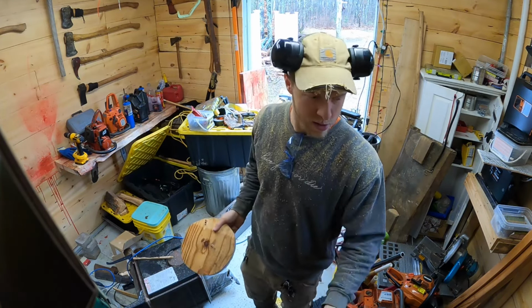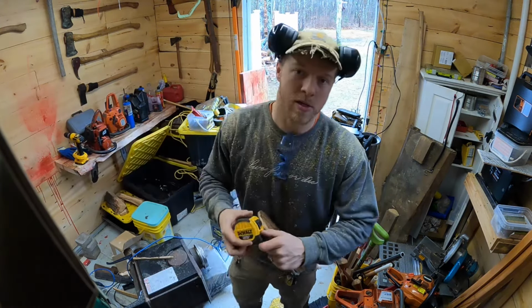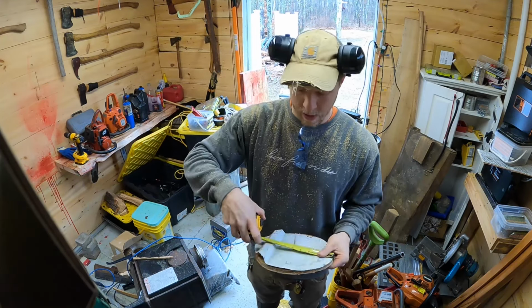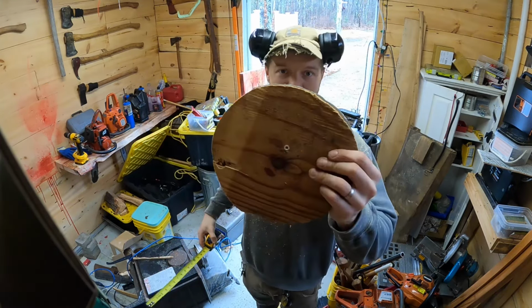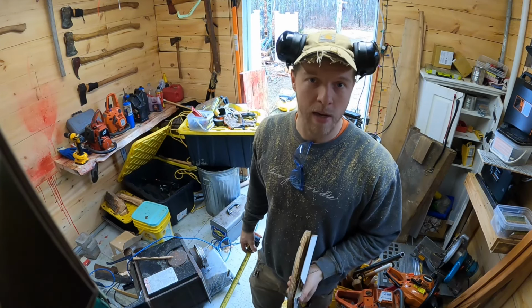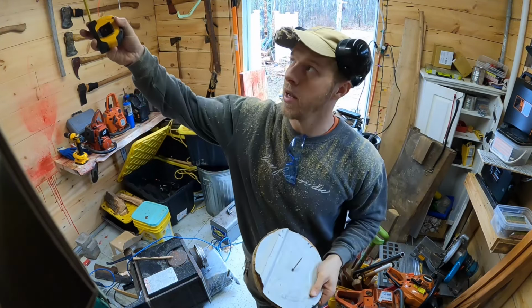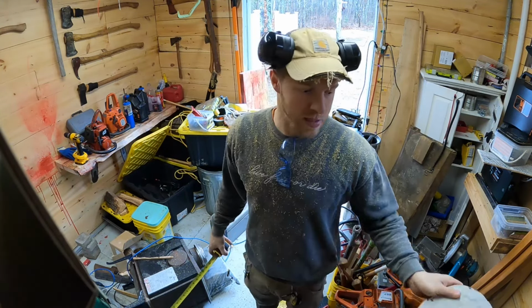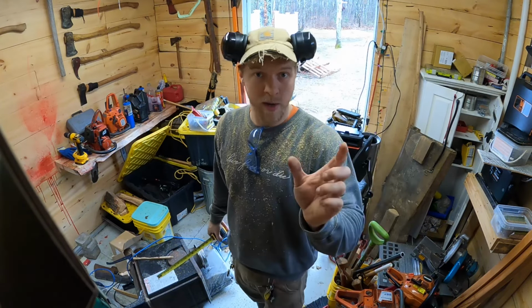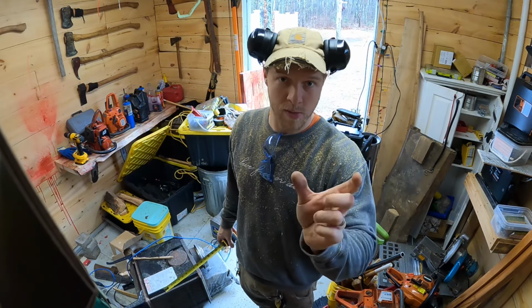The issue we ran into, and this is a wood stove installation mistake, is with your double wall chimney pipe, that's the silver pipe that you saw last video. We cut a hole 9.5 inches, right? The double wall pipe is only 8 inches wide. So we had double wall pipe rubbing on the plywood up on the ceiling, which is not in code and can cause a fire hazard. The double wall chimney, per the manufacturer, needs 2 inches of airspace, non-combustibles around it.